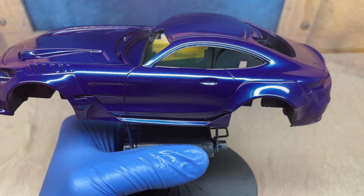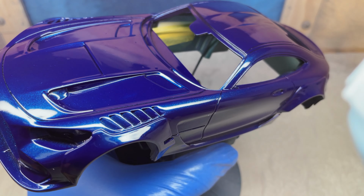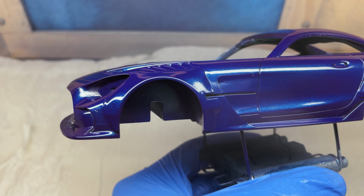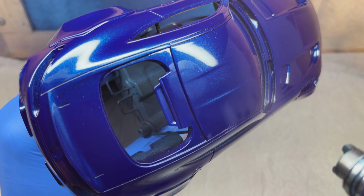Thinning ratio and temperature go hand in hand. With higher temperature, you need more thinning. You can see, if you follow this rule, it's giving a forgiving surface look and feel, flattening out on the surface without any issues.